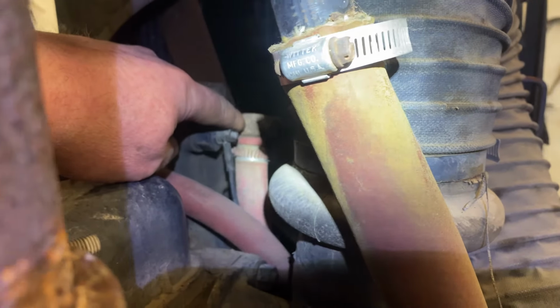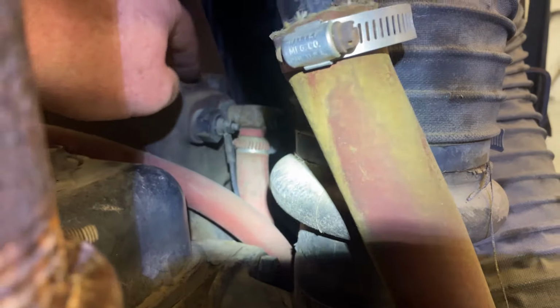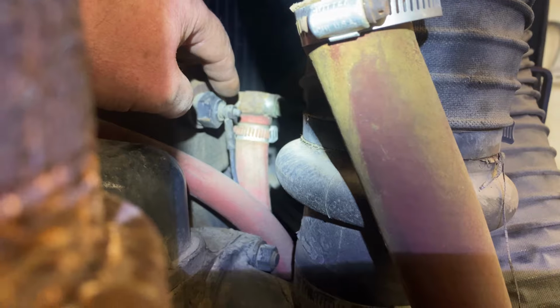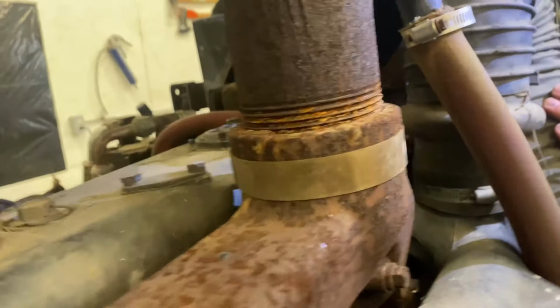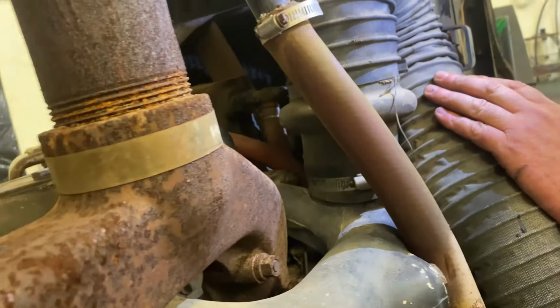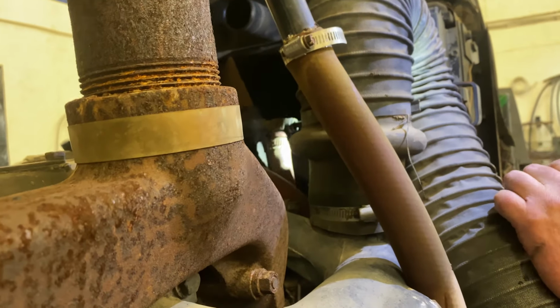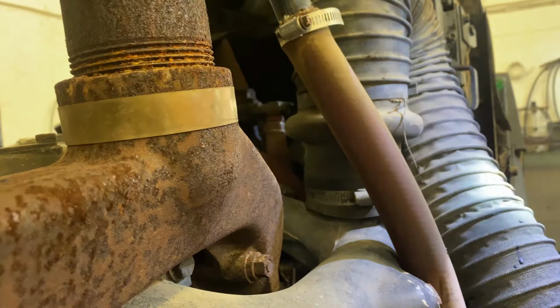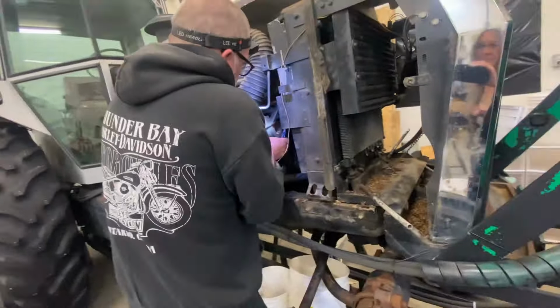So before we put the thermostat cover back on, we're going to disconnect that line and the line that brings the cold water from the cab back to the other side of the water pump. And we'll see if we can blow air through now. So I'm just loosening off the hose clamp here. Probably impossible to get on camera. I do have the light. That's impossible. All I see is junk. I can't even see it. This one is in a real prick of a place.